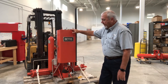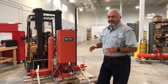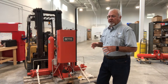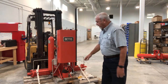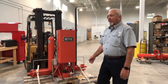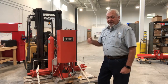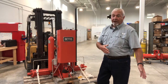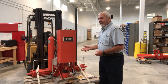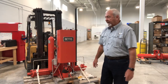When you get one of these, first of all, it is imperative that we know what valve this is going to fit on, because this valve is manufactured without a bracket. We have learned how to fix that if we find that the valve is not actually a Cameron 8-inch, but in fact a Grove 8-inch, or a Delta, or a KF, or something of that nature.